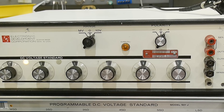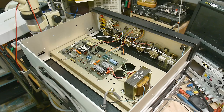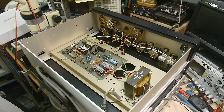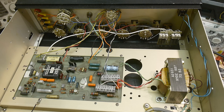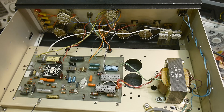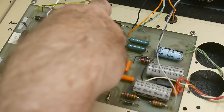Let's take a look inside because the internals are quite interesting. Just two screws and the top comes off. There are the insides — very, very old-school, all hand-done, single-sided PC board, might have been etched by them. There's a transformer here, wires with strain relief coming in, and everything is exposed — if you touch here you'll zap yourself. The power supply is here and these caps look pretty crusty; I'll probably want to recap this thing. Here is the actual circuit that does the real work — some transistors that are probably voltage regulation.